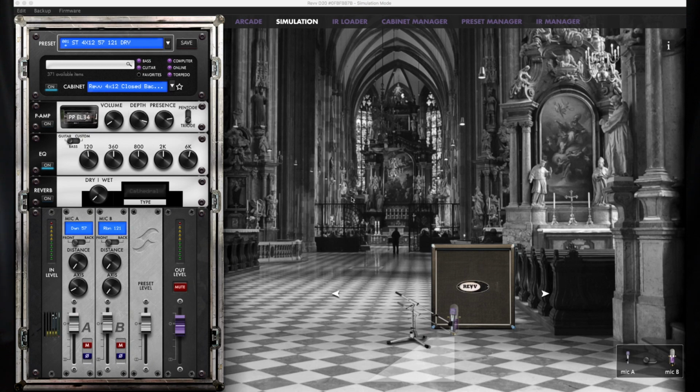So first of all, the thing I think I should point out is that switch only applies to when you're using the 2-notes embedded software and hardware. Basically, what this switch allows you to do is either put the software before the power section of the amplifier, which would be in pre, or after the power section of the amplifier, which would be post.